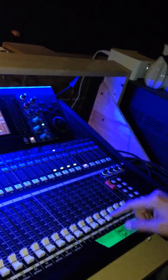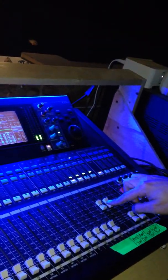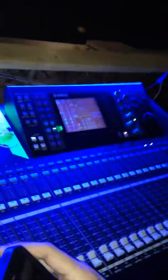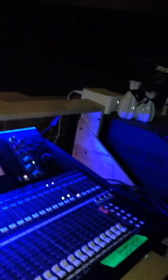Make sure you turn the channels on and slide the faders up. If you want to use the iPod, just hook it up and move the switches. Make sure before you plug or unplug that it's off, otherwise it pops. If for some reason you don't have any sound whatsoever, first make sure you turn all the breakers on in the back. Second thing to check is make sure this master is turned on.